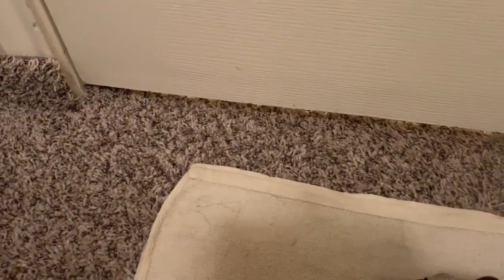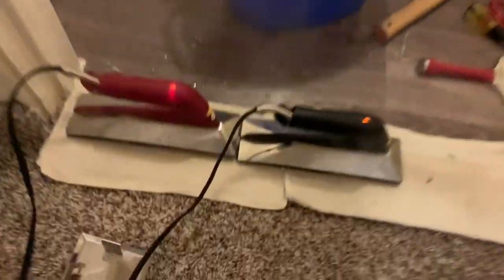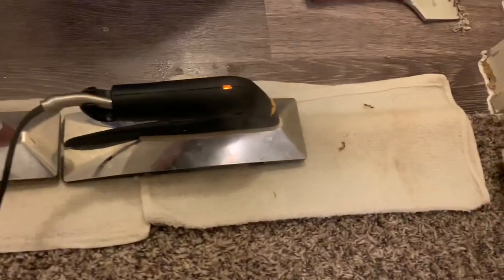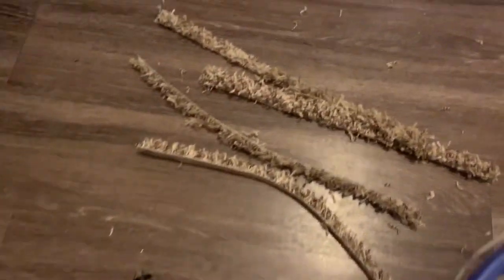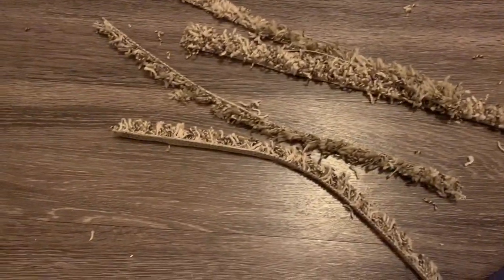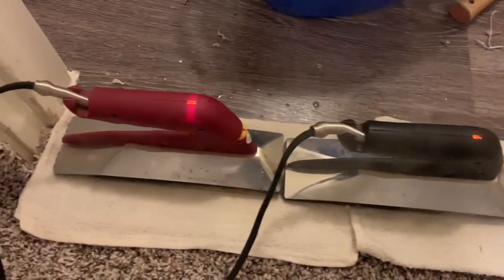After this I'll basically tuck this in, cut that off, sit over here and trim up this edge a little bit — get the math right so it wraps around the z-bar. I'm warming that edge so it'll bend over really easy and tuck under the z-bar really tight. I made two cuts: the first was a longer cut and the second was a little bit shorter, adjusting the length just right so it's going to fold over at the right length. Pretty close to bend right now and the heat will take care of the rest of it.